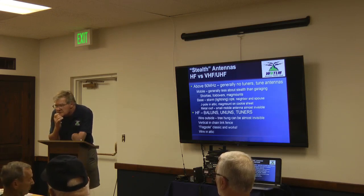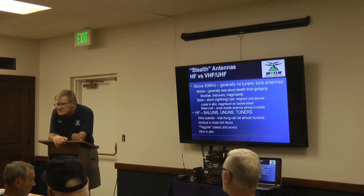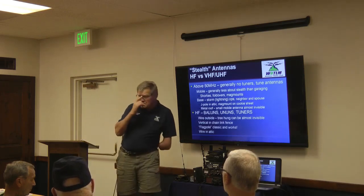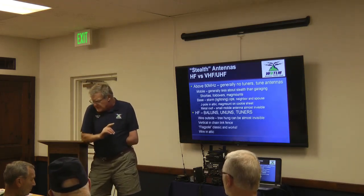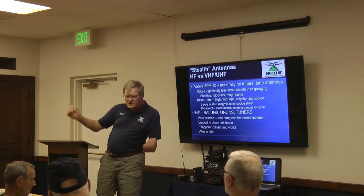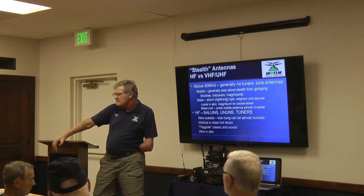Who remembers the Waldo fire? Yeah. I was at Red Cross headquarters operating about 18.7 for 5 days on that until the fire was over and everybody was pretty much done, and the Red Cross started parachuting in millions of people to do something, and we moved to a different location. But from Chapter House down on South Colorado Springs, I don't remember who brought in his VHF portable or mobile, and we literally took a cookie sheet, stuck a mag mount on it, put it in the window, and we operated the entire Waldo fire on that antenna. Do you have to ground the cookie sheet?